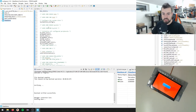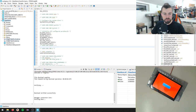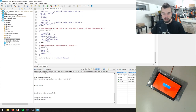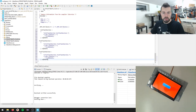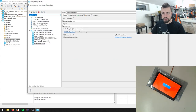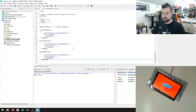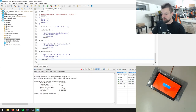Yes, I know I could edit this out but I want you to see my failures as well. Let's try adding the external flash one more time. Go to the linker script, add the quad SPI region, insert all the sections, save, go to debug configuration, add the external loader, apply and debug. We should see the quad SPI memory region come up again - and there it is.